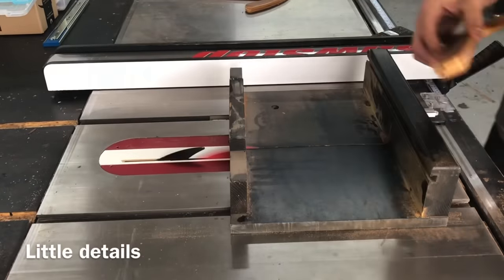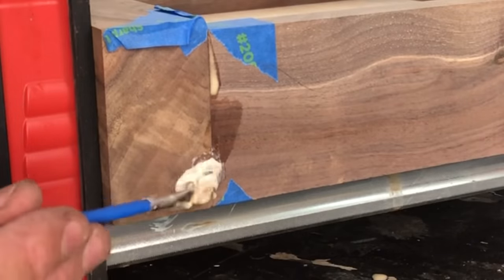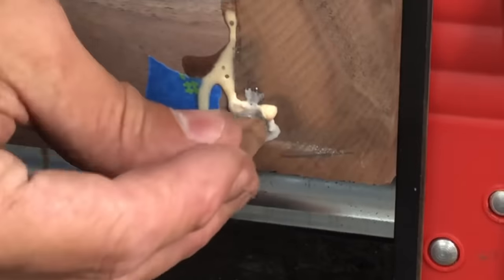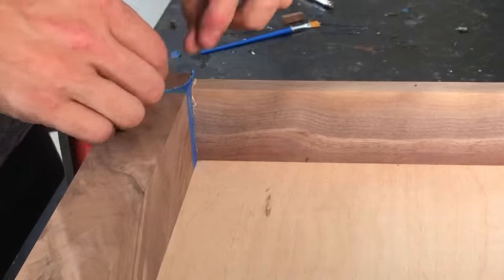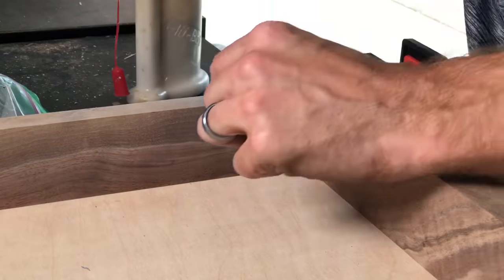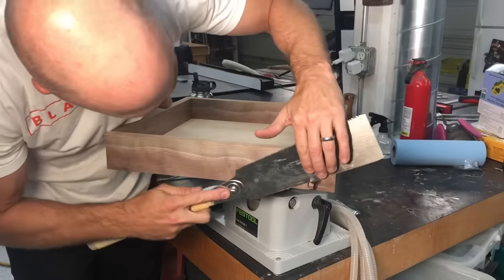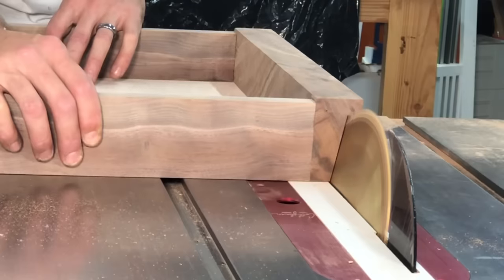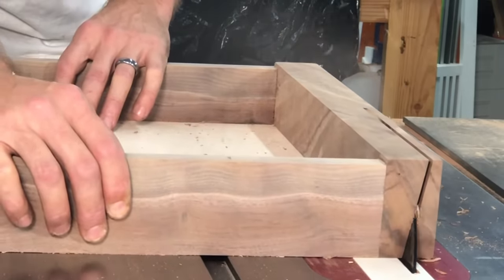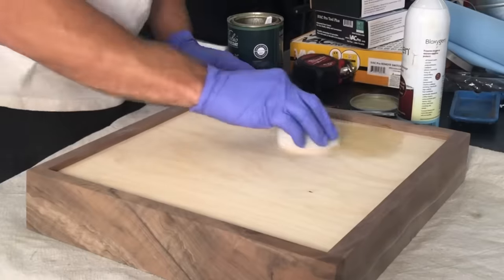Since this drawer was going to be suspended from the top I didn't want a separate drawer front, which is why that little dado square is stuck there. I wanted a one-piece drawer front, so I cut a little square in there and added a little bit of wood glue — by the way, I'm using Titebond III, but I just learned from a really reputable cabinet shop that they don't recommend using Titebond III with walnut. They said the original Titebond is the one to use, and that Titebond III has been known to fail with walnut. I posted that on my Instagram and got a ton of people saying they've never had a problem with Titebond III, but I also got quite a few messages from people saying they've had failures on their cutting boards with it. So I am going to pivot and start using Titebond Original when gluing up walnut.